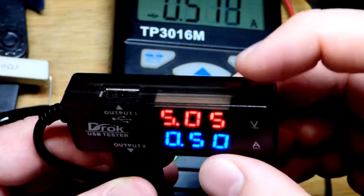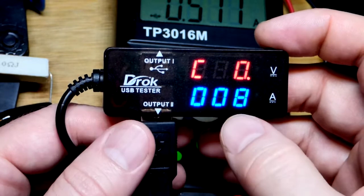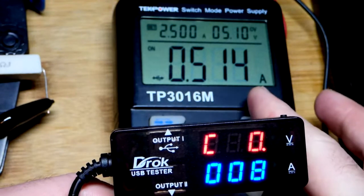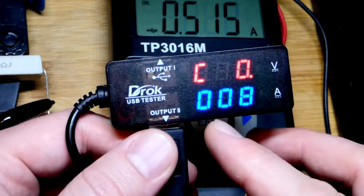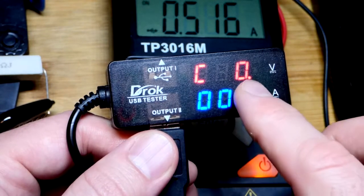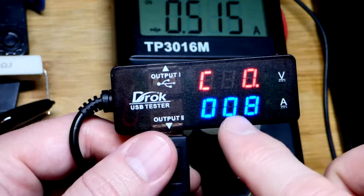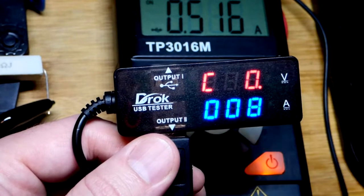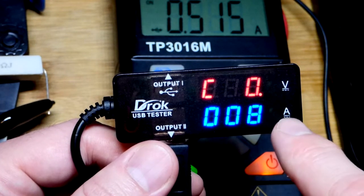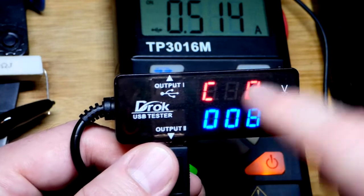To make changes to this, there's only one button. We'll hit the button — now it's not voltage and current anymore, now it's capacity. I reset this because I'm shooting the scene again. We got 500 milliamps or 0.5 amps as we saw before. After an hour, this is going to say 500. After two hours, we're going to have 1,000 — that's 1,000 milliamp hours. It just counts up the current and the amount of time, and that becomes the capacity in milliamp hours. If we had one amp passing through for an hour, it would be one, and after two hours it would be two.